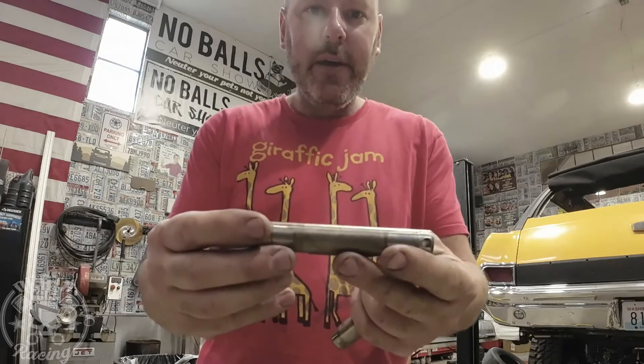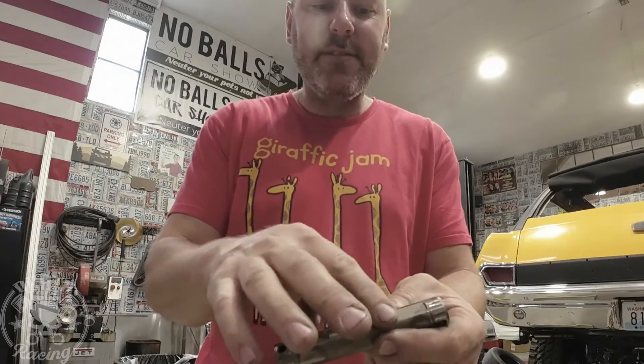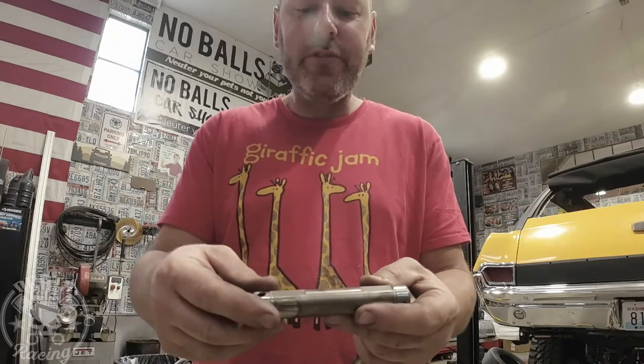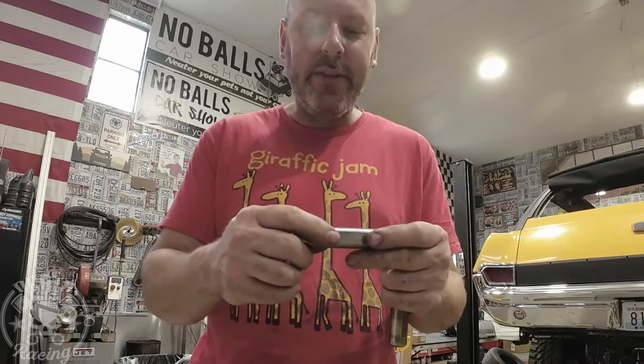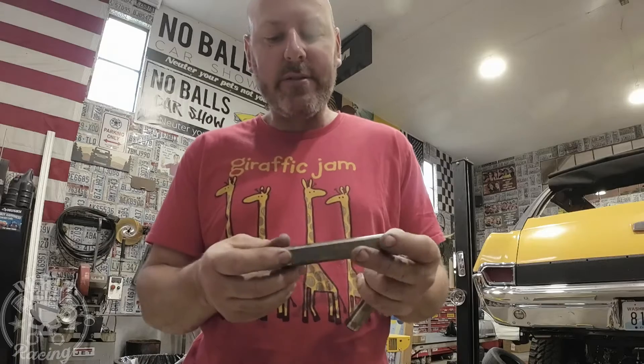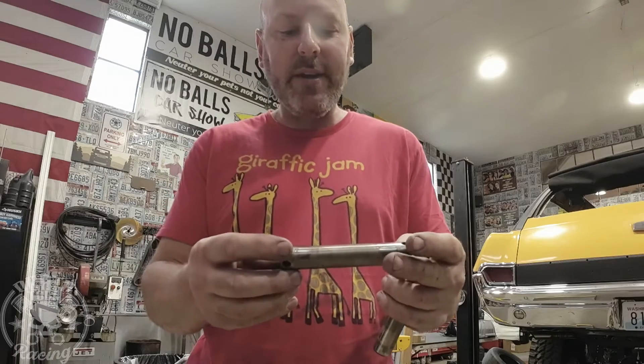And that's this pin. I machined it on the same side as the flats, then milled in and drilled a new hole, so now our oil holes are 90 degrees from where they originally ran. That's not a big deal — that isn't going to cause any issues whatsoever — and I still retain the entire sides, minus just a tiny bit, for that spider gear to run on. I think this is a much better way of doing it.